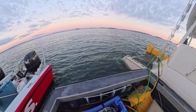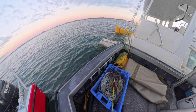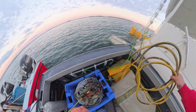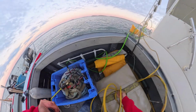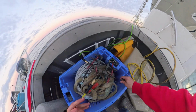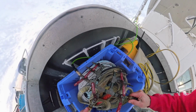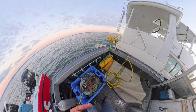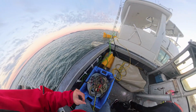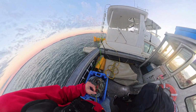See now the bag that we had rigged is inflated somewhat. It can still get some more air in there, but it's not doing too much. We have some other options we could do to get that side out of the water more. We could rig another bag, we also have a line tied to the fly bridge that if we had to, we could hook a tow line to it. You can see that black line hanging down there, and we could start to try to heel the boat over a little more with a towboat if we had to.